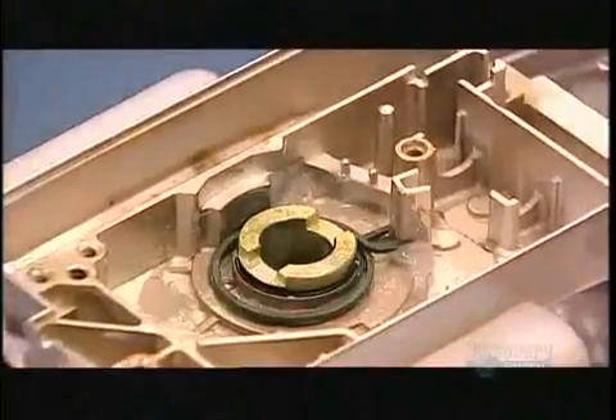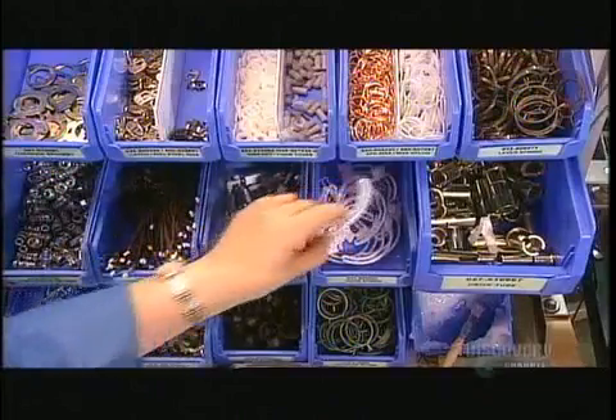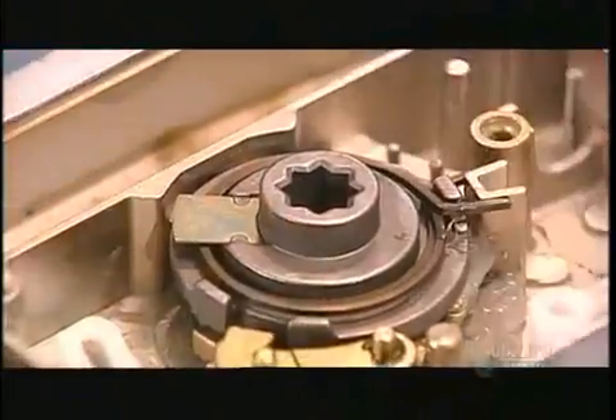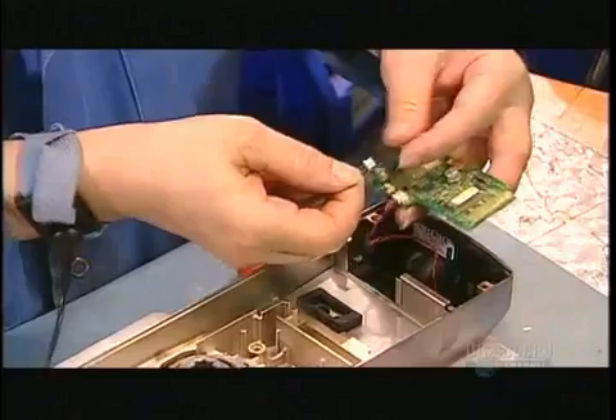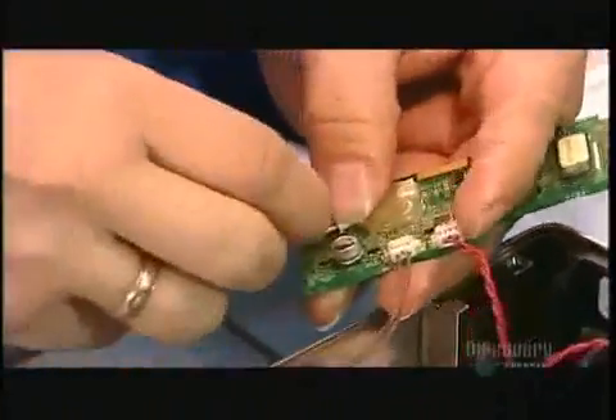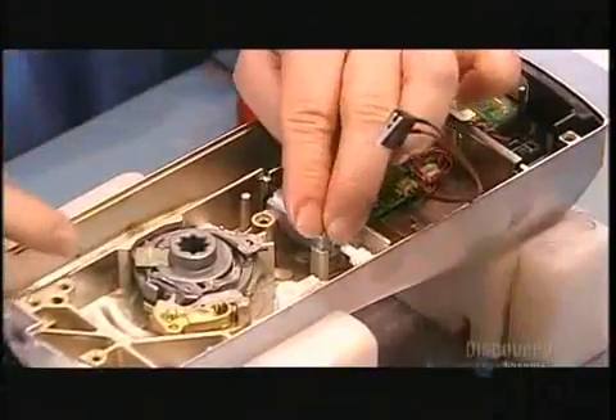Next comes the drive tube, onto which the lever will be assembled on the other side. There are several clutch components that link the lever to the latch. Swipe the right card, and they permit the latch to retract. After applying more lubricant, they install an override that enables the hotel to open the door with a key if, for some reason, the electronics malfunction.